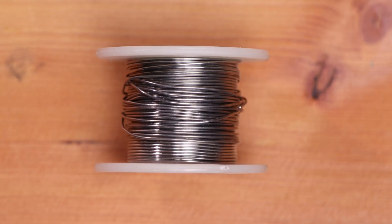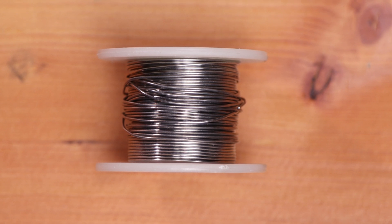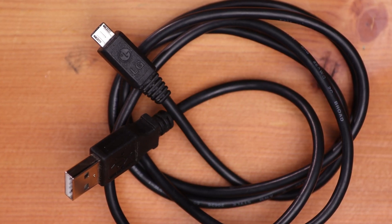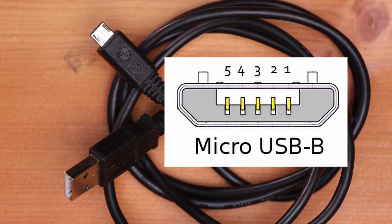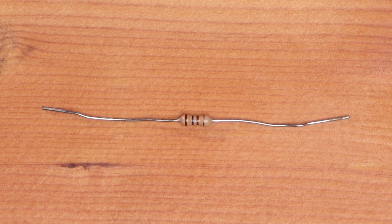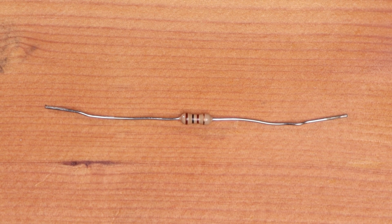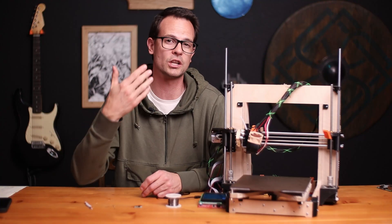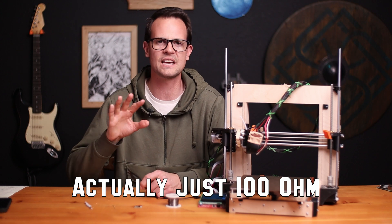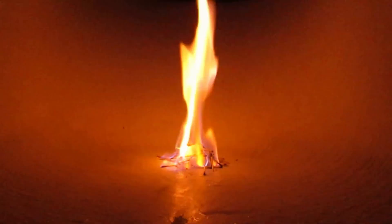You'll need a little bit of solder to solder those wires on. You'll also need a power cable to power the Raspberry Pi — mine takes a USB micro connector, so I'll be cutting a cable and soldering that on to the output of the buck converter. Also optionally, you may want a resistor for when we're fiddling with the output voltage, just so there's a load on there. I've got a 100K resistor, just to hopefully make sure I don't burn out my Raspberry Pi.